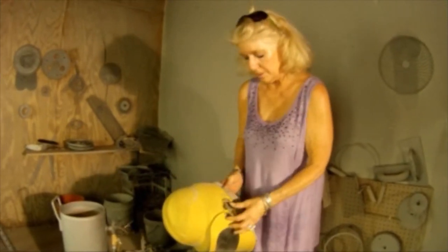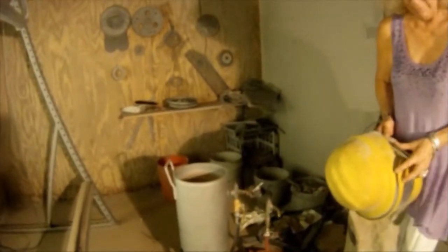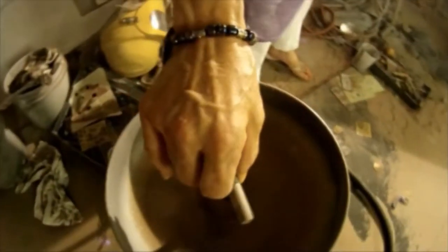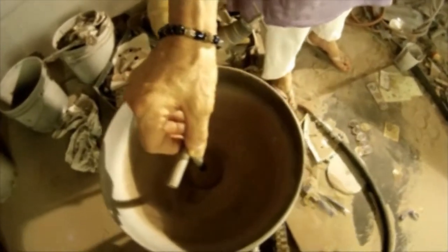The sand goes in this canister that you see on the floor, and it's reusable. It's aluminum oxide. You pour it in, turn the pressure on, pull the damper up, and it seals itself, and it holds 50 pounds. So basically, it is a very simple procedure. It's very painstaking, and it takes a lot of patience, but it's not rocket science.